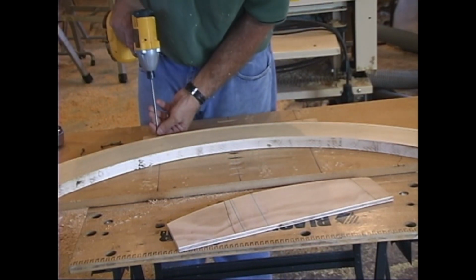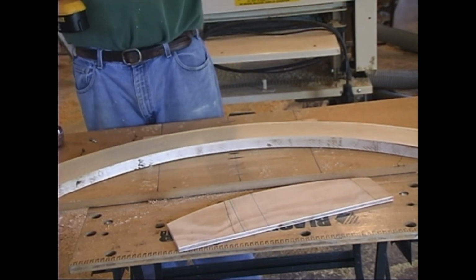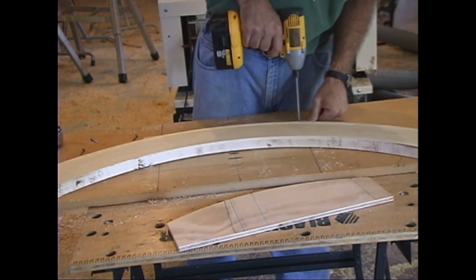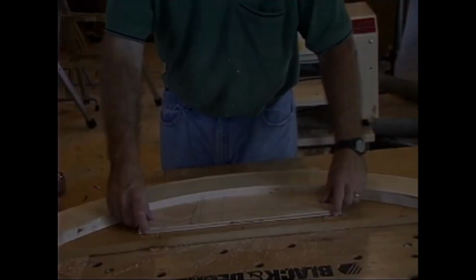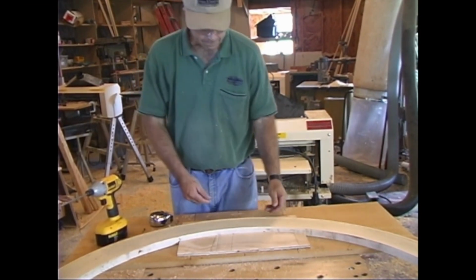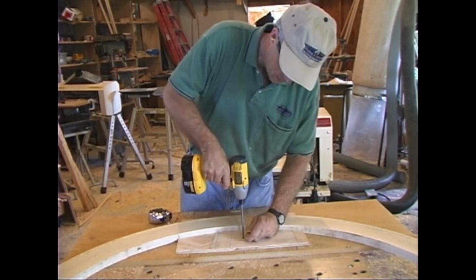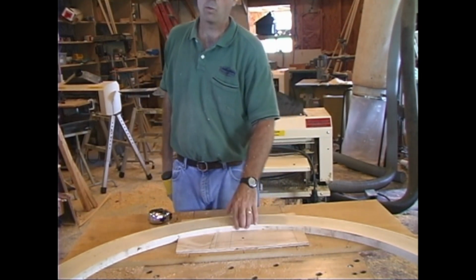I always put three screws to hold these guide boards in place so that if even something binds up a little bit and one of the screws were to break, the molding should still continue to run through. Of course, I only started doing that after I had one break and ruin a big piece. And I don't really want this to be absolutely tight. Having a little bit of a gap is a good thing. So all that's really important is that the lowest point of the cutter knife swing, that this be centered up and square with the cutter.